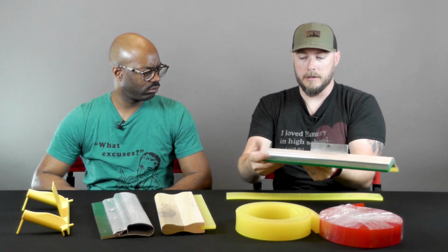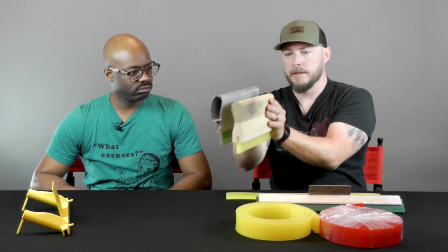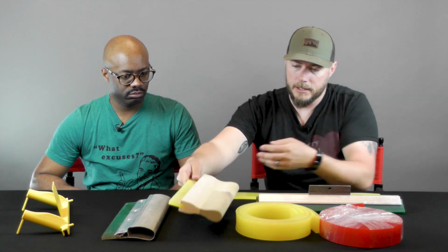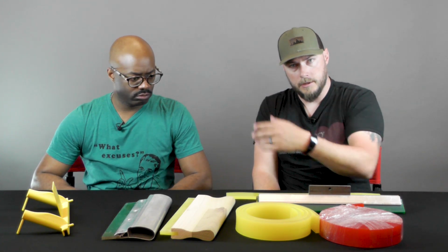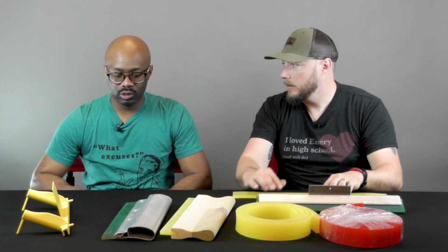When you're talking about what's called a chopper system, there's two squeegees that go up and down. So it goes down, it floods, and then it flips and prints. On your flood coat, you're definitely wanting a lighter durometer so it distributes more ink on that flood, in my opinion. And then on your print stroke, do something like a 70 or even an 80 on an auto.